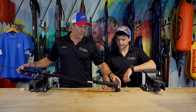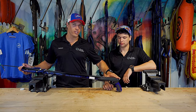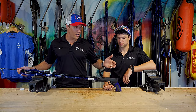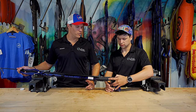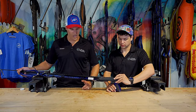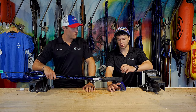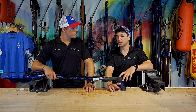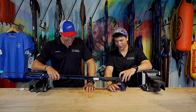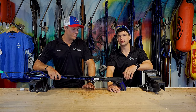On the top you have your safety. A lot of people end up messing with their safeties and changing things up. A little bit of super glue in there is definitely not a good idea because you want to use your safeties. As they say with safeties on firearms — they're there to be used, not trusted. Be sure that you do use your safety, just don't ever trust it. This is definitely still a weapon and we want to treat it as such. I get guns that come into the workshop where people have tried to glue their safety, and they bring the gun saying 'my gun doesn't shoot anymore' — and they glued it in the safe position. Or a little bit of glue gets inside and actually messes up the whole mechanism. So just leave it alone.